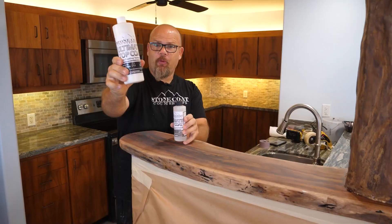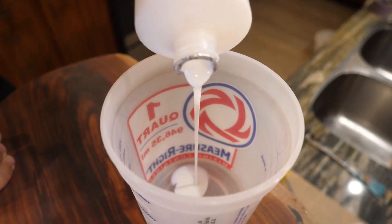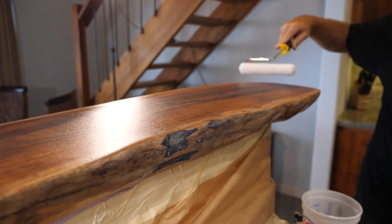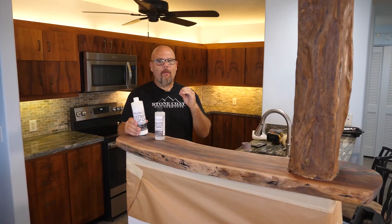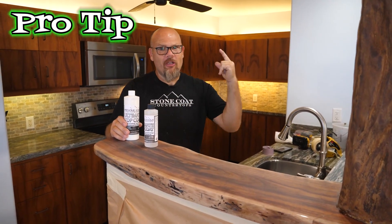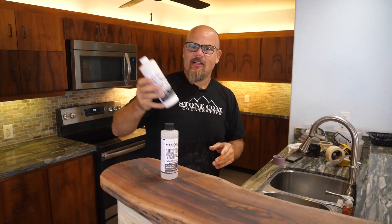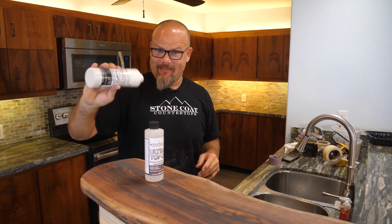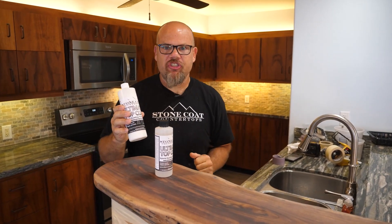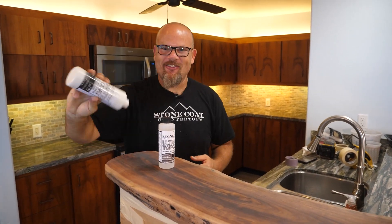Our Ultimate Top Coat is a two-to-one ratio — two parts resin to one part hardener. I'm going to mix just enough for this wall cap and pillar. I'll heavily saturate the product and then remove the extra saturation with my dry roller. By applying too little material you'll get dry spots and inconsistencies — pro tip: get it on wet and dry it up for a really good finish. I'm going to mix Part A before adding it to my cup to make sure the matting agent — the secret sauce that gives the lower sheen level — is fully intermixed. Shake it before you bake it.